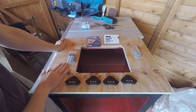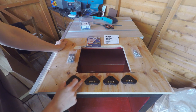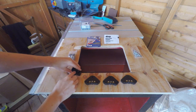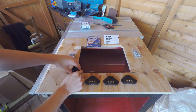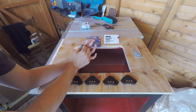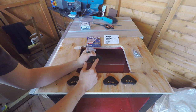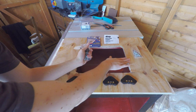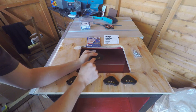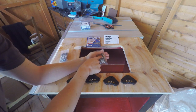I've flipped the tabletop over and as you can see there's a bit of tear-out underneath, but that shouldn't affect things too much. I've unwrapped the insert plate levelers and as you can see they've got a recess for the corner that helps align them in the right position — you can't put them in the wrong place, they always register into the corner. I've got four of them, one for each corner. You also get the leveling threaded rod inserts that go into the two side threaded portions on the corner leveler itself, so those can be raised and lowered to bring the insert plate flush with the tabletop. Then you've also got the bolts that go right through the insert plate and into the center one just to secure everything into place.